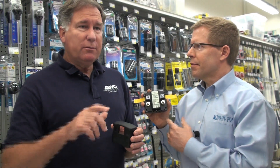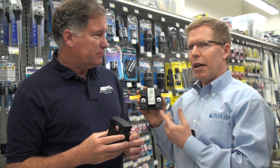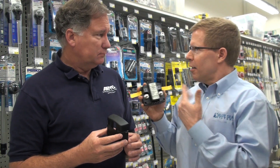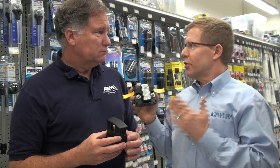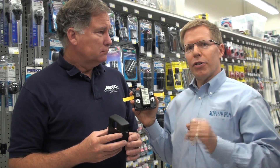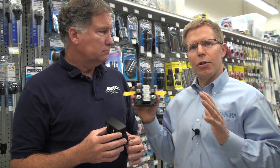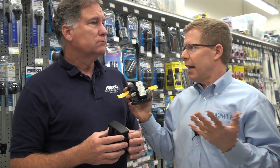What would be the problem of just putting your battery switch on "Both" and leaving it there all the time? Well, a lot of people do that — when I was introduced to boating, I did that. And it works as long as there is a charge present. If you are running out to a fishing spot, you are great at charging both batteries. The problem, though, is that when you turn the engine off and there is no charge present any longer, you can potentially run down both batteries and then have to make that embarrassing call to have someone come out and tow you.